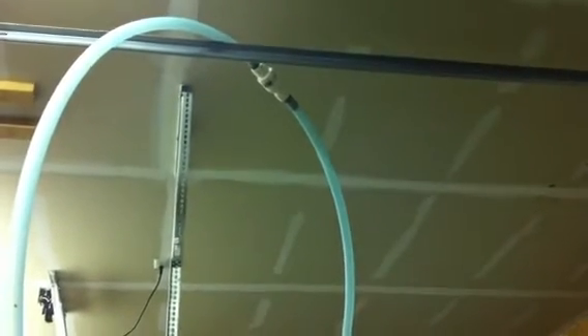You see a check valve up there because this is going to gravity feed in the sugar bush — this is actually not a vacuumized line. I need a check valve there to be able to vacuumize this line, but I also wanted this line to be able to drain back into the pump when the pump is not running.